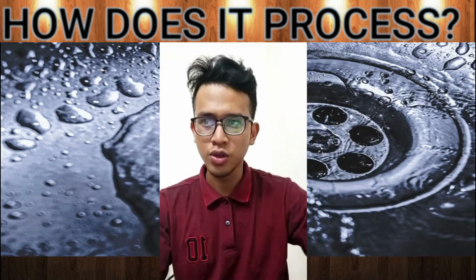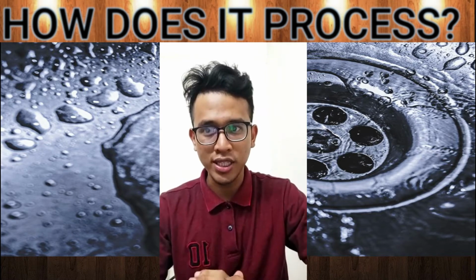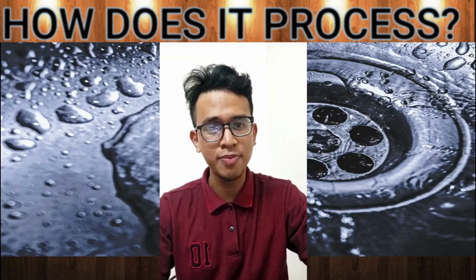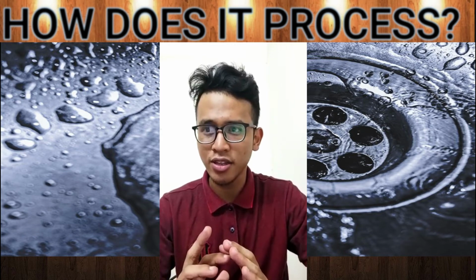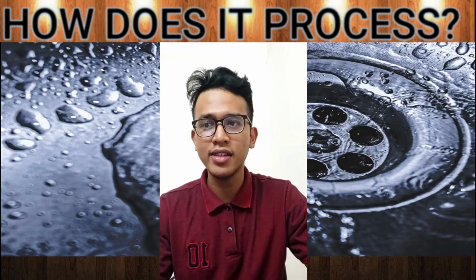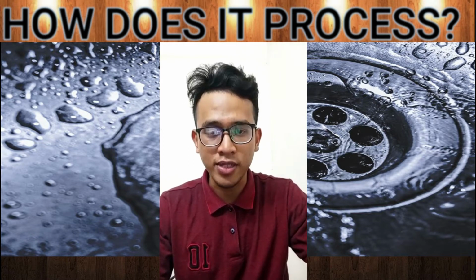So the first thing is raw material, that is purchasing. The thickness of steel plates commonly used in stainless steel sinks is between 0.8mm and 1.5mm. Next, the sink factory purchases steel plates of different widths according to the needs of the production sink models. The steel plates are sent to the sink workshop in the form of rolls. Normally, untrimmed steel plates have a maximum width of 1220mm and have almost unlimited length.